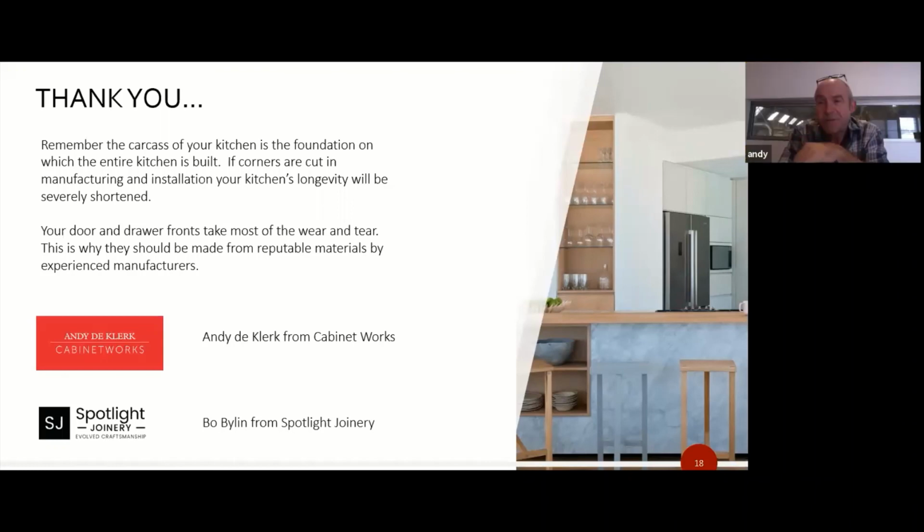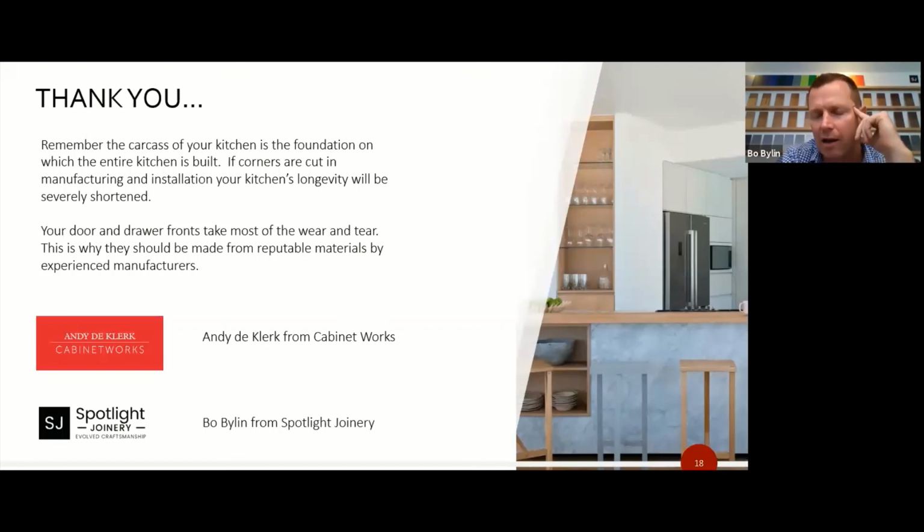Go for it, Bo. You first. So I would generally specify that you would want a finished floor. We would want at least all your plumbing points and electrical points in position. From a ceiling point of view, we would want the ceiling to be skimmed and primed, or in an ideal world, finish painted. All walls need to be plastered, skimmed, and at least base coated. And obviously windows and doors have to be in. That's not negotiable. So that would be what we would want as a bare minimum.